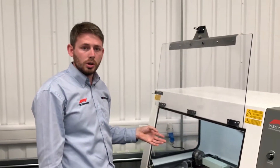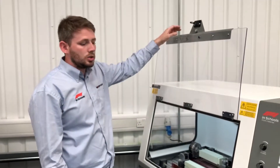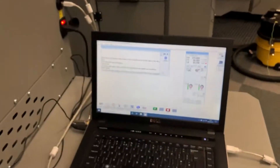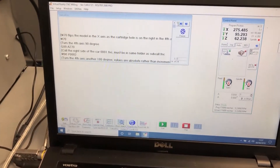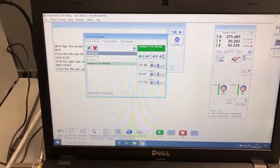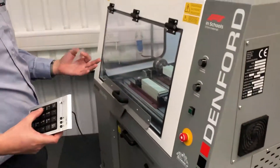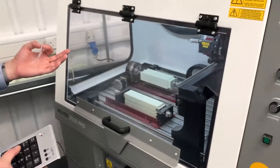Because we moved X minus 10 to run the second program, we need to reset the X again. So back to the computer, go into the Work Offsets menu and then into Jog. Using the keypad again and the piece of paper, we need to move across to touch on the right-hand side of the billet. Once you are somewhere near and comfortable, you can open the door to reduce the speed.